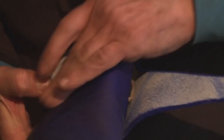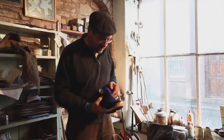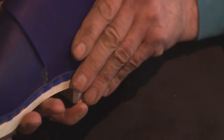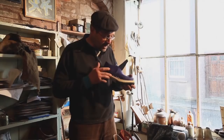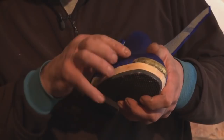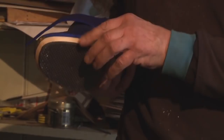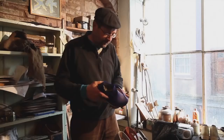I'm using a standard clasp front with actually one of my shoe upper patterns. When I used to make shoes a lot, one or two people wanted their clogs like this. I've got a strap over and a bolt. The interesting thing is you can't see inside here — this is level right through to here. Her toe stops about there and she can't easily, without pain, bend her foot. So what I've done is taken the curve out — she's got a flat platform inside to put her foot on, and she can still walk in these quite naturally because they've got a rocker in them. Obviously if she can't bend her foot easily it's not particularly painless for her to walk, so we're hoping she'll be able to walk pain-free in these.